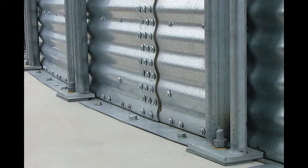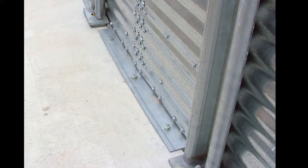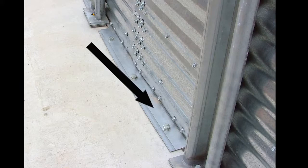The base angle is also securely bolted to factory punched holes in the bin sidewalls. The Brock full sweep system also provides reinforcement to the bottom tier sidewall body sheet to firmly anchor the bin, as well as seal the base of the bin to help prevent moisture penetration.